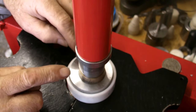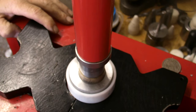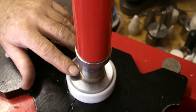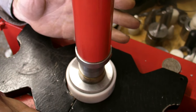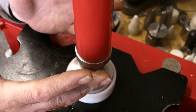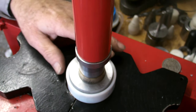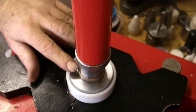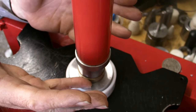Right, cone number two with push through cone number one spacer. It's always your first one to start with. And as you can see from the angle of the cone, you get a good fit. It's a steady start without pushing the walls bang too fast and the opportunity of splitting your coin is higher. So with that angle like that, we're more or less onto the expansion spacer on the top already with a few pushes. See what I mean there? The way we're actually there already without having to push and the walls come out and push in and split.